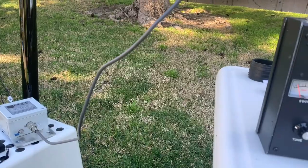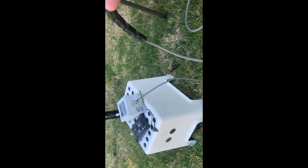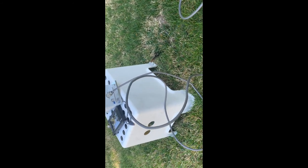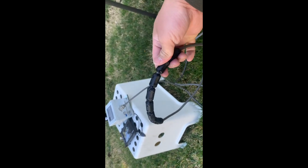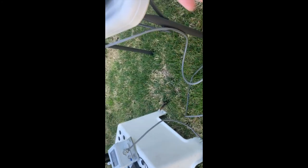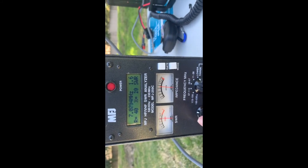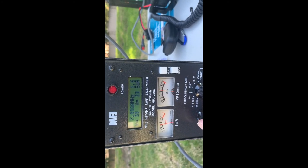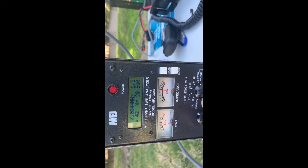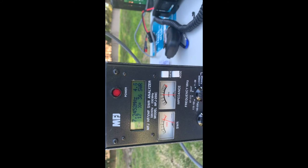The coax is three feet. According to one theory, this coax is part of the antenna. What I did is put in a six-feet-long coax and use this to stop the common current. Let's see if it improves. At the 40 meter band around 7.08 MHz, it is at 1.6 SWR. It's worse than earlier — worse than the short cable, which I remember was 1.1.